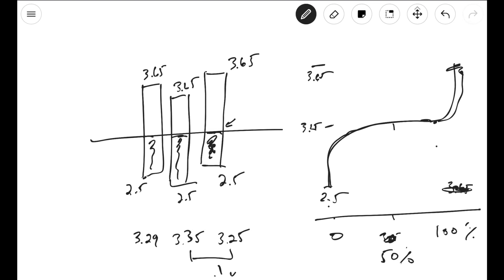What's going to happen if I don't balance? Let's say I charge up my cells, and I've got a BMS, which is going to stop charging as soon as one cell gets to 3.65 volts, and it'll stop discharging as soon as one cell gets to 2.5 volts. When we're charging, we're moving this line up — every cell gets an equal amount of energy. Then we have to stop, because the middle cell is now at full capacity. The cells on the outside aren't at full capacity, but the middle cell is, so we've got to stop. The BMS clicks into place and we're done.